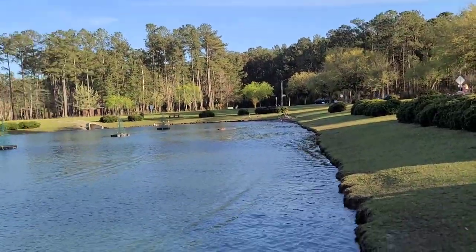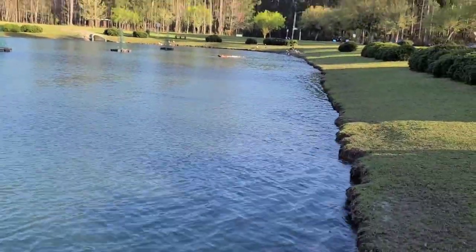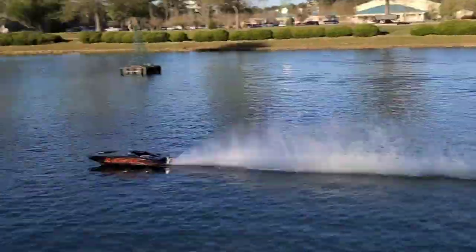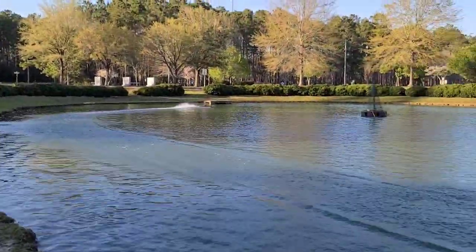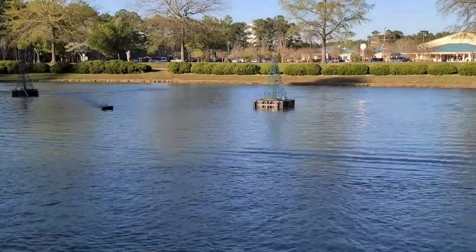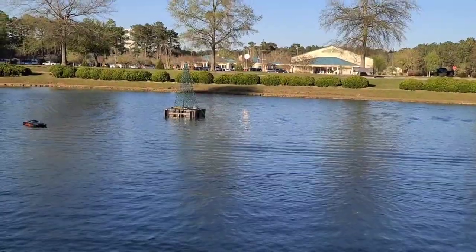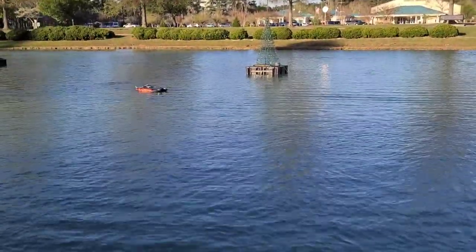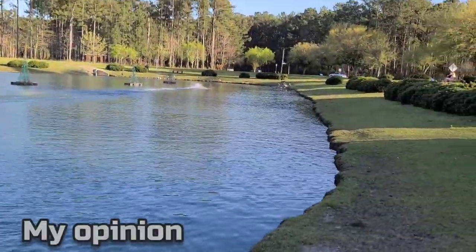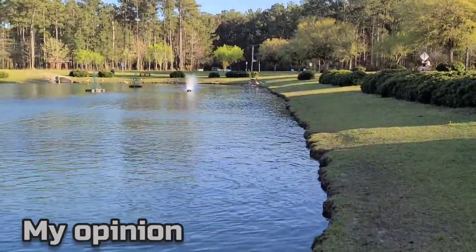With a catamaran, I like to run, and I like to tune my catamarans with weight and stinger adjustments. Catamarans don't necessarily need trim tabs, okay? I mean, trim tabs will help any catamaran, it really will. But catamarans are tuned with weight distribution and strut adjustments. That's the way they're tuned. That's the way they've always been tuned. Like for my Blackjack 24, I would never put trim tabs on that boat. Never.